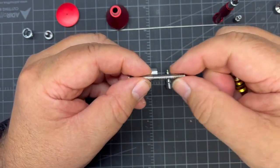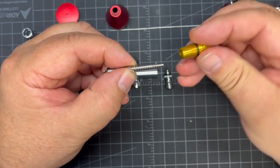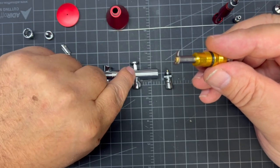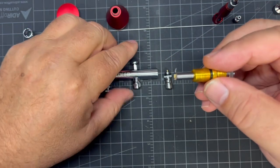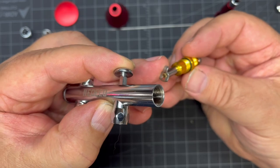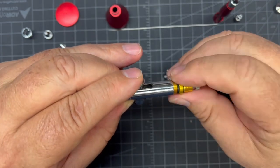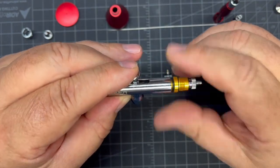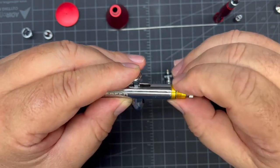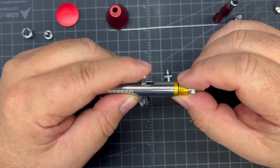Now putting the spring back on, the spring backer, and the back piece. Remember this isn't attached — if you tilt it upside down without keeping your finger on it, the trigger will fall off and you'll have to start over. This little piece goes up against the back. Bring it in and screw it on until the gasket seats. No tool tightening needed — just hand-tight is good. Now we have spring pressure on here.